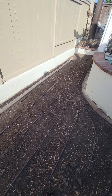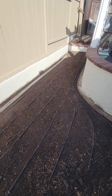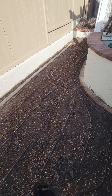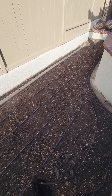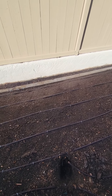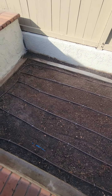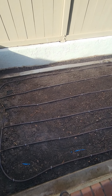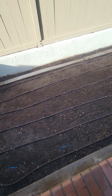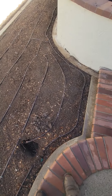Going down to the other end, we have T's that come off the header line running down through the middle. I keep it about half a foot from the edges to make sure the edges get water, because concrete edges and any solid surface tend to heat up more than other areas and dry out faster. So when I do the installation of the subsurface drip, I try to take it within six inches of the edge to ensure adequate water flows right to the edge of the project area.